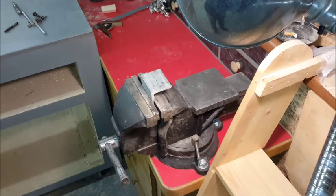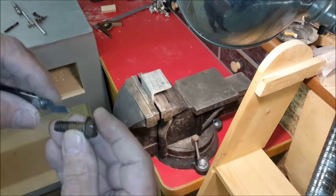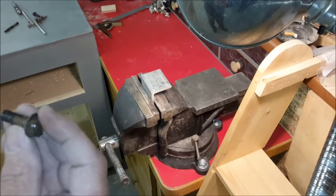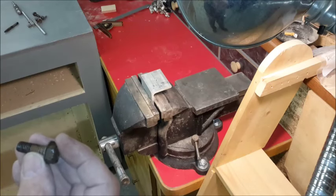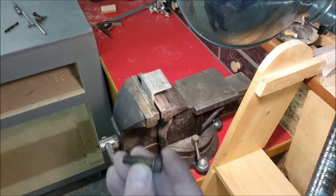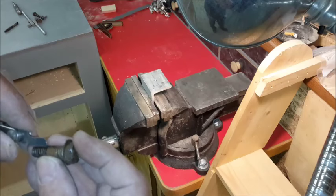Okay, back over here at the vise, and I'm ready to tap the holes for these mounting brackets. And depending on how you arrange your bolts and nuts and such, if you just throw them all together, that could be a possibility of a hazard in that you might have the stupid M word bolts mixed in with American bolts. But in order to tap it properly, use the proper tap, you have to first use the proper drill bit. And then how do you determine that? Well, you first start with your bolt threads